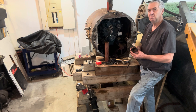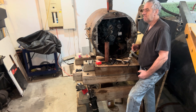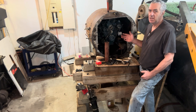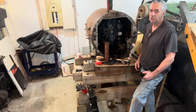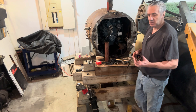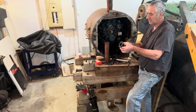I'm only making a water-cooled section from the exhaust manifold to this flexible coupler. The last engine did have a water-cooled exhaust manifold, but this one is smaller. According to ChatGPT, I have enough steel mass here submerged in the water that I won't have an issue with cooling. When I was testing the Yanmar engine it stayed nice and cool even just sitting in my shop, so I'm confident this will be good. This simply bolts on to the side of the manifold, and then I've got a 90-degree elbow that I will weld on right here.